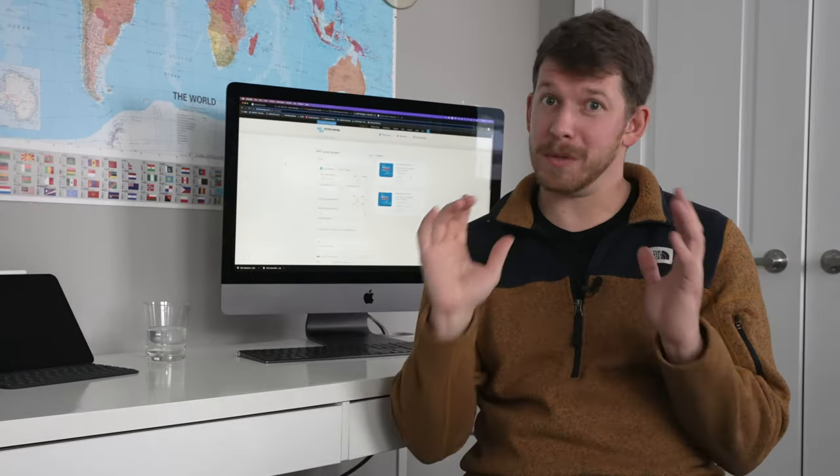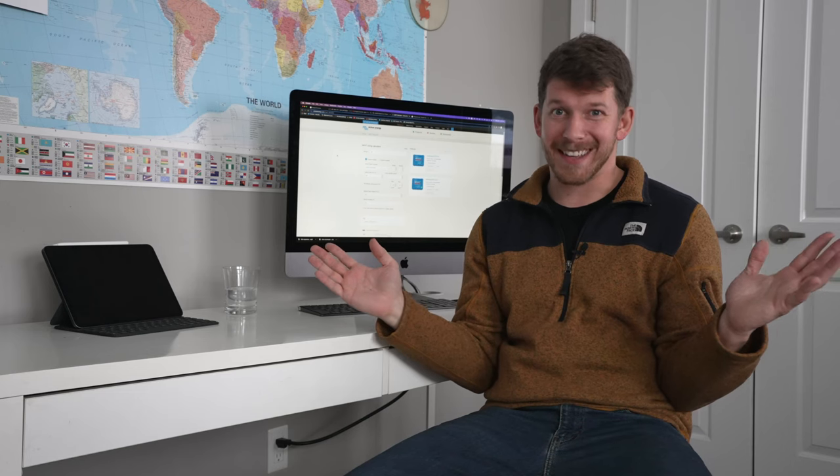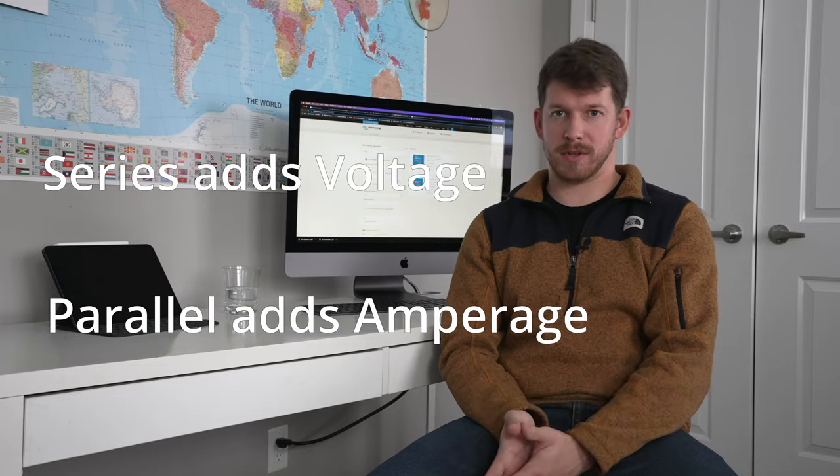So let's talk about batteries — my favorite subject. Stephanie is tired of hearing me talk about batteries. This is an area where you can save a ton of money. If you're currently in the market for a Battle Born battery or similar pre-built 12-volt battery, hold up — I'm going to save you a bunch of money if you pay attention. You could save thousands of dollars by building your battery yourself, and if you intend on using more than one battery in your system, you're already building a battery yourself — so why not save money? The only difference is understanding parallel and series connections. Series connections increase your voltage and parallel connections increase your amperage. In a series connection we connect the positive and negative of one battery to the next; in a parallel connection we connect all the positives together and all the negatives together.